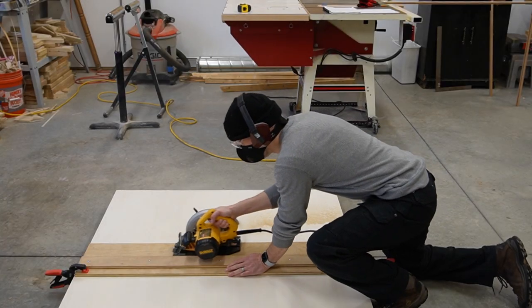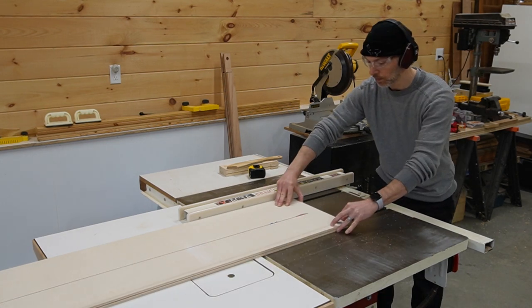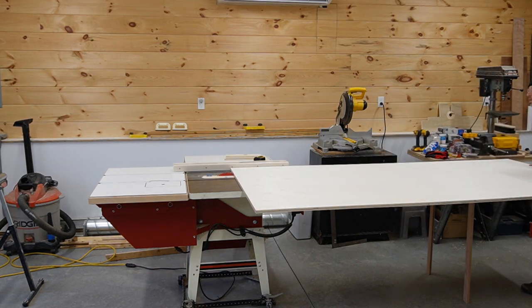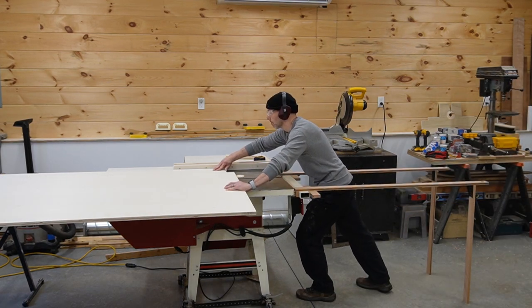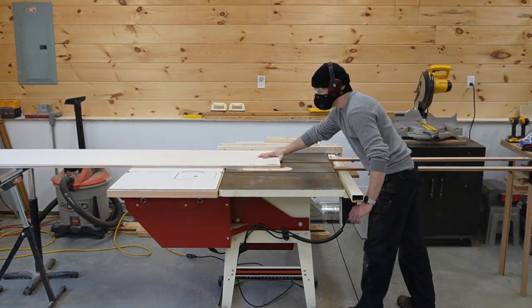To build it I break down full sheets of plywood using a combination of a circular saw with a homemade track and the table saw. In the past I'd always place foam under a sheet of plywood and cut it on the floor, but just before this project I saw a video from Jay Bates about infeed support legs, so I had to make a pair and try them out. They work great and make ripping a full sheet much easier and safer, though you still need proper outfeed support too.